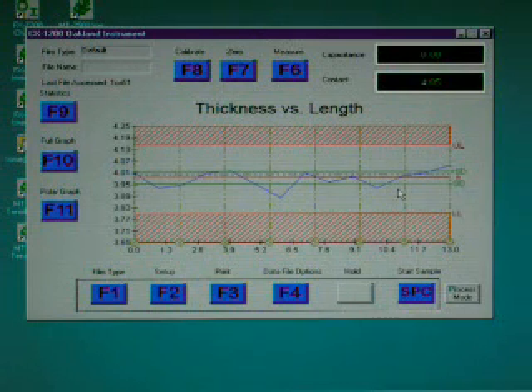If following ASTM or other standards, you are typically required to record product description, sample conditioning procedure followed, instrument configuration and setup, testing technique used, specimen nominal thickness, principal directions tested, approximate age of sample after manufacture, date and operator name, average thickness and thickness range, together with the standard deviation and number of specimens tested for each caliper.